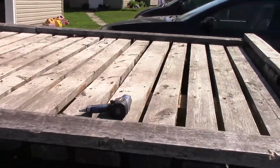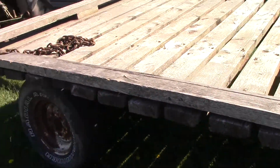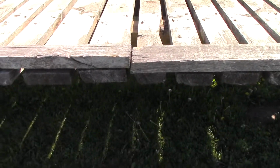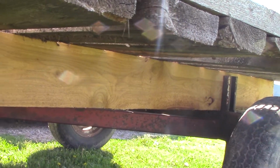And all we did was we went along and pulled the nails out of the decking on the one side. And then I was able to put the beam in from the one end and slide along. Jess was able to come along and lift the 2x6s. And we got her in there. So everything's good and solid there now.